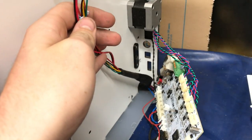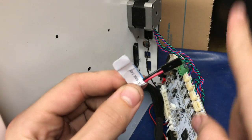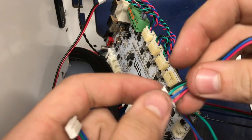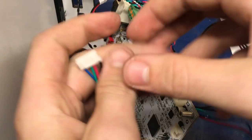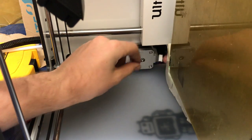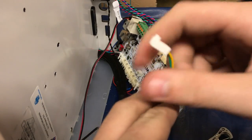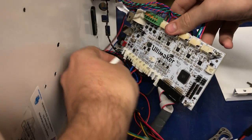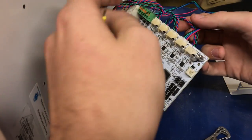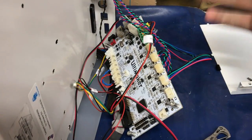I've got all the new wires here, so it's time to start hooking them up to the board. We're first going to start with the heat sink fan — the black wire we're going to make sure is facing this way, and then we're going to plug it into the little header back over here. Now we're going to take the extruder motor wire, plug it in at this end, and bring it through here to connect to the motor. Next we have cooling fans — cooling fans are going to plug in right down here. Now we're going to take the temperature sensor — this one says hot end temp — and plug it into T1. The last thing is to plug in our heater wires. There we go, we've got all of our wires connected.